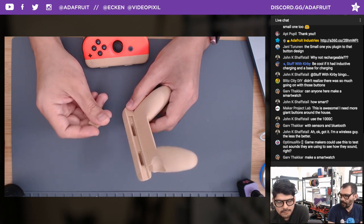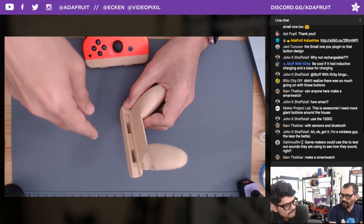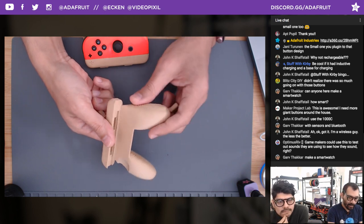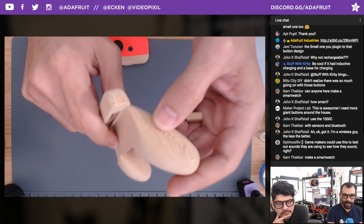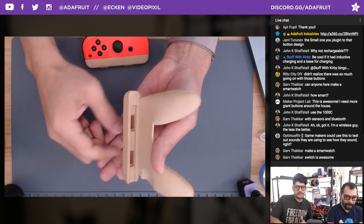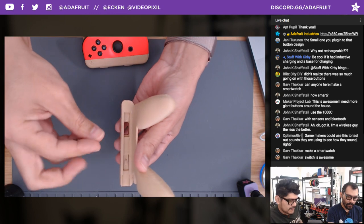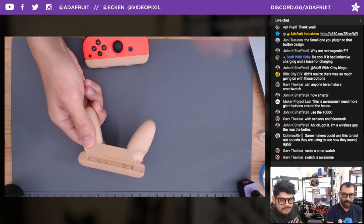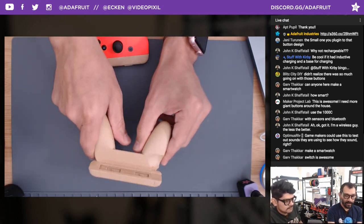Unfortunately, this was before the 3.2 beta was stable. So I really wanted to test the tree support structure that they have. But the zigzag support pattern worked out really well. There wasn't any filing needed to remove it, even though it looks pretty coarse. It's nice and soft just because of the wood filament that we used on that. It gives you a bit more grip, and I like the feeling more than just regular PLA. It's a little fibrous. It's kind of neat. This is a 30% infill, and even with all that, it still feels nice and light while still maintaining its strength.